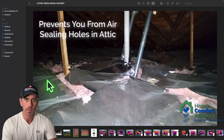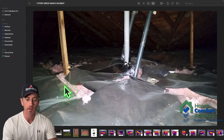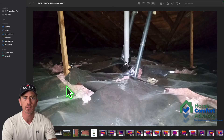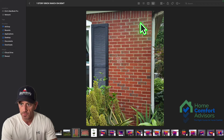Laying it over the insulation means it doesn't allow you to add any more insulation to the attic after it's installed, and it doesn't allow you to air seal any of the holes that go through the ceiling of the house up into the attic. If that air sealing isn't done before this is installed, the radiant barrier basically has to be removed and pulled back so the work can be done properly.